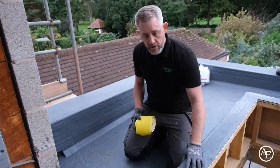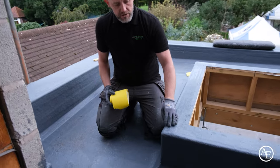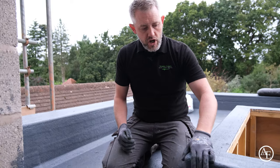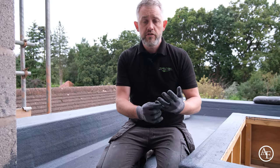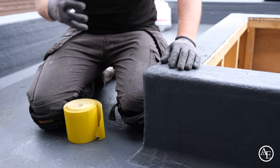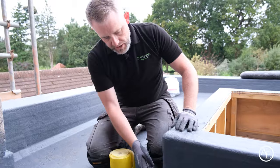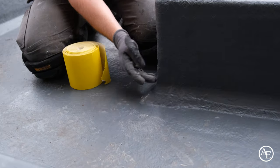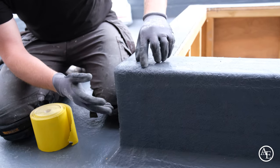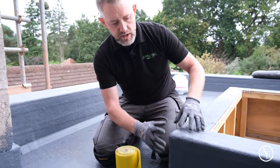We've done our upstands, totally waterproofed and consolidated — we're happy it's waterproof. Now we'll look at sanding down. We're looking for any issues with the fibreglass: pinholes, sharp edges, and what we call wicks — bits of fibreglass coated in resin sticking up off the surface. Sand those down to get the surface nice and smooth, so when you do your flood coat you get a perfectly smooth, consolidated finish. For sandpaper, you're looking at around 60 grit — quite harsh, so it takes material off and lasts a bit longer. Any hard lines where you haven't fully consolidated the mat need to be addressed.